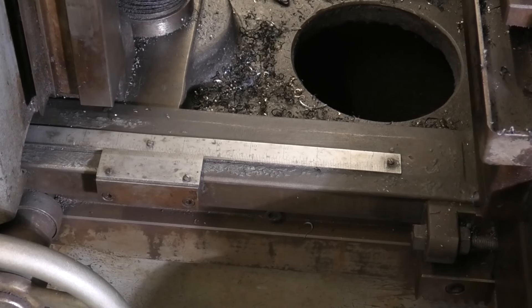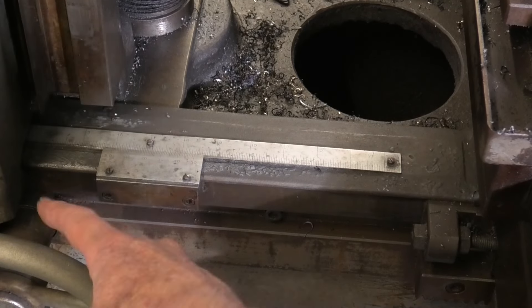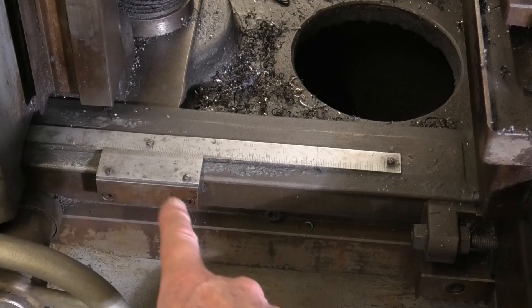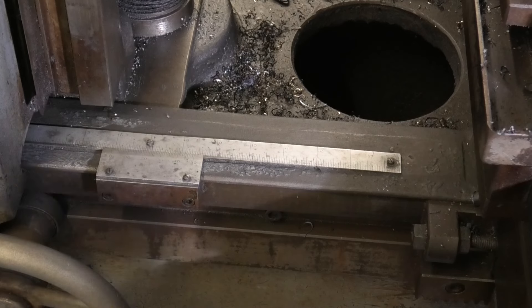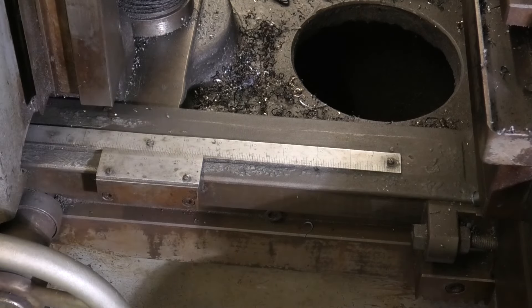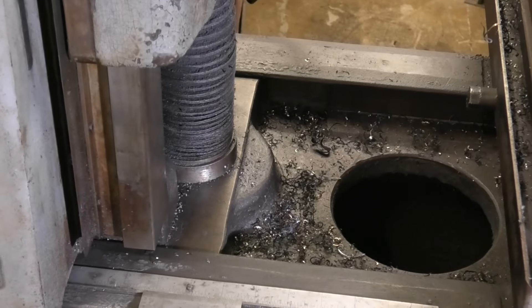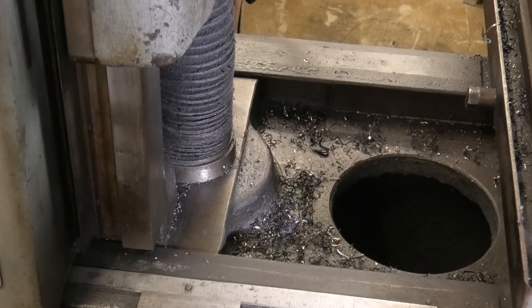Here's a close-up look at the way covers on the spindle end of the carriage. These are covers that slide backwards and forwards with the carriage to try and keep the swarf off the ways — quite a good idea. And this vernier there measures the table travel. It's quite easy to put a bit of marker pen on there to show where you want to finish up. And to the left you can just see the bellows or concertina for the feed up through the head there.